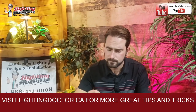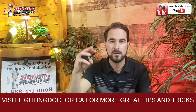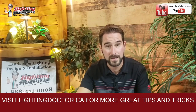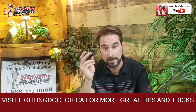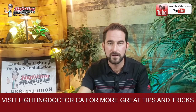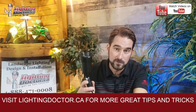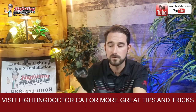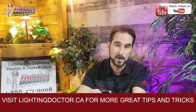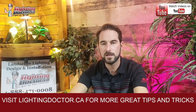The only thing to remember is whether it's Bluetooth, Wi-Fi, or color lenses — when you add color, it makes it less bright. So you usually have to bump up the intensity somehow. If we're putting a lens, we'll usually just pop in a brighter bulb. Or if you're using a Bluetooth or Wi-Fi option, you just set the setting a little bit higher. So many things you can do — the most versatile light on the market, FX Luminaire's RS LED uplight. It now comes with a drop-in bulb, but you can go and swap that out for whatever you need.